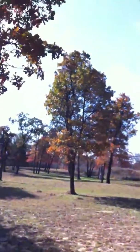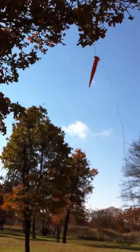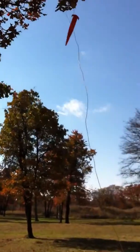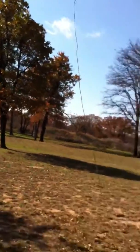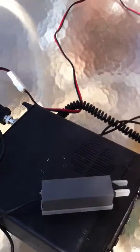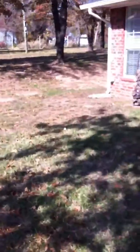I've got a wire thrown up in a tree there. That's a tent stake that I used as a projectile to help bring the wire up. It's just connected with some binding posts on the back of the radio. I'm using another battery to relieve strain on the antenna so the radio won't get pulled off the table — it's real windy today. And I have a counterpoise just running across the ground.